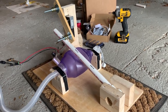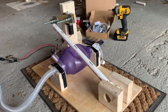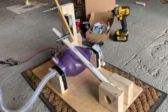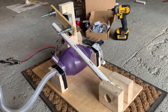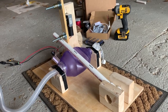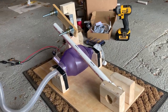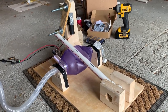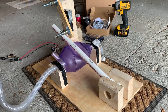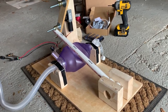This is cobbled together from commonly available parts. There's nothing too crazy here or too hard to obtain — that was part of the design philosophy. You can see there's plywood, there's 2x4s, there's some Velcro. Probably the most complex parts are the skateboard or rollerblade bearings on the little metal axles that push down on the central PVC compression lever, as well as the DC motor that's driving it all, and the little PWM module that helps control the rate. Both electronic parts are just sourced through Amazon and easily available.